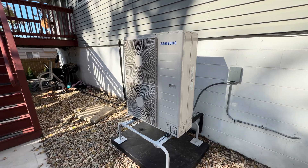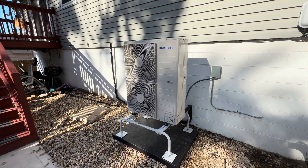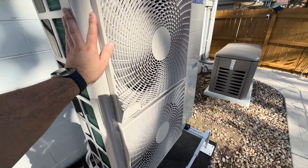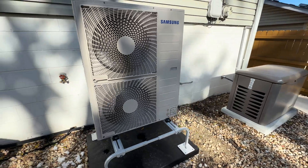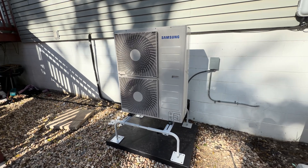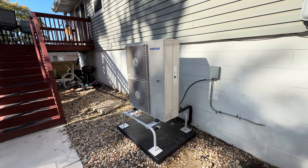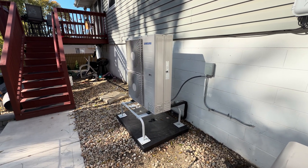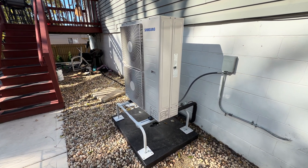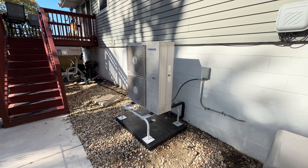This unit is doing the heating of the building most of the year, and we do have a gas furnace inside — we'll take a look at that in a minute. Some of the highlights of this unit: it's a variable speed compressor, which means it adjusts the amount of heating and cooling it provides based on outdoor temperature and the homeowner's thermostat setting to provide much more consistent temperature management — stable room to room, time of day to time of day, with minor swings in comfort, both summer and winter.